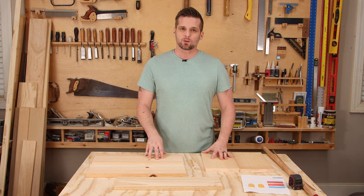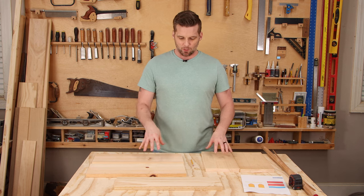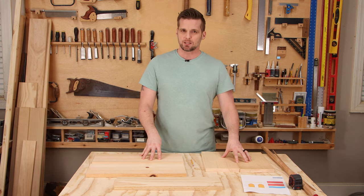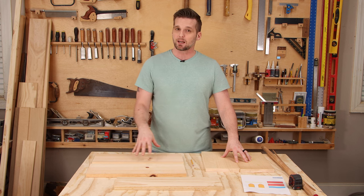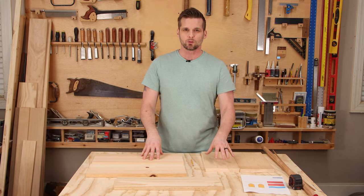The last project is a wooden tote. It's made up of five pieces of wood and then a one-inch dowel, and we're going to start by working on the sides and the end pieces. The sides get a little dip cut out with the jigsaw, and then the end pieces have some angles and a hole drilled for the dowel.